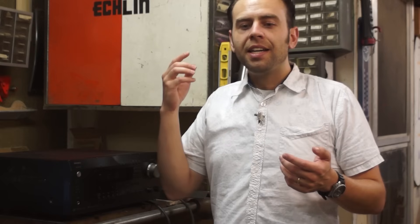The one that I bought, this had already been done. The previous owner had already replaced all the capacitors with brand new 100 microfarads and he still couldn't get it to work. So he sold it on to me. I bought it thinking, hey, even if the HDMI board is bad I can still use 130 watts per channel times 7 — that's certainly an upgrade from what I was using. So I bought it, opened it up, and did some troubleshooting.